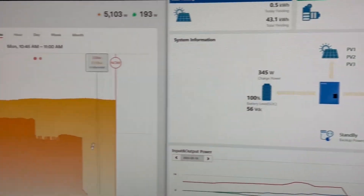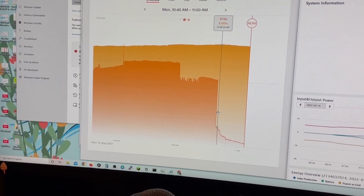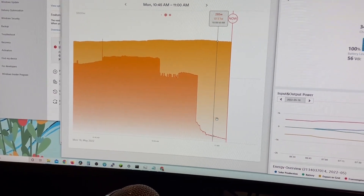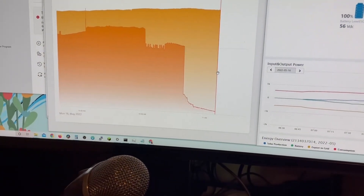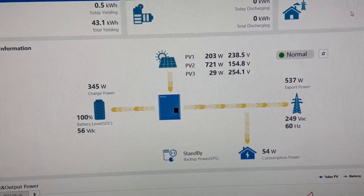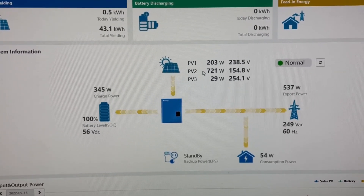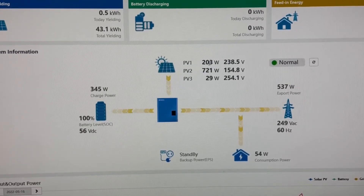Which is not really being sent to the grid — well, I guess it could be, depends on everything else. The big thing I was able to fix today is that I'm no longer getting power spikes. The dark orange line is what I'm using in my house, and you can see it's no longer going up and down — it's a much more consistent line. The fix was that the PV2 array had some leakage to ground, and I think that was just from moisture. Panels can only handle so much moisture, and getting them up off the ground a little bit so they can air out is working just fine.